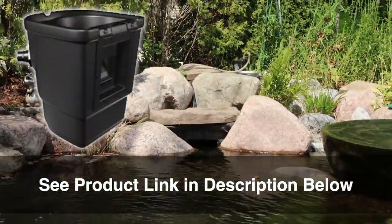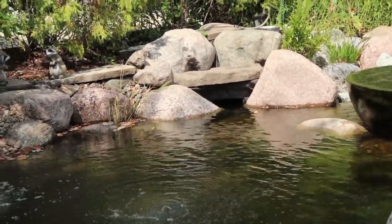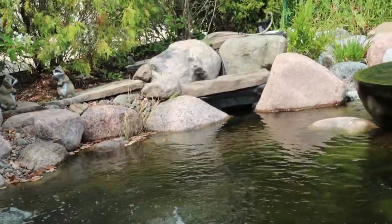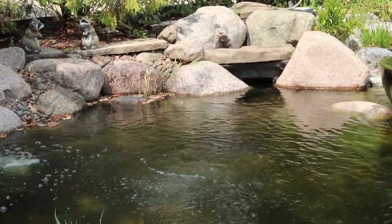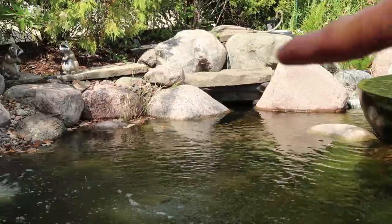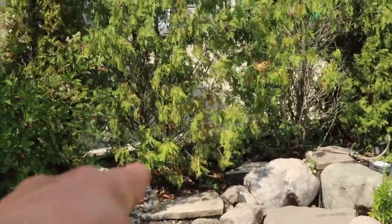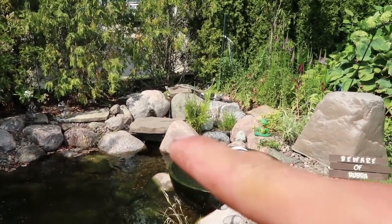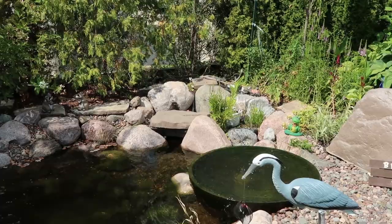Because of topography on this site, the elevation back behind that skimmer box is about 14 inches above even the top of the skimmer box, and we had to sink that skimmer box down considerably in order to maintain the water level in the pond as well as maintain the functionality of the skimmer. We had to sink it down, but you can see the stones back behind the skimmer — that's retaining all that soil from the raised berm that goes all the way back. This is the lowest area of the yard over here. That was a creative solution to disguise the skimmer box without making it feel weird.